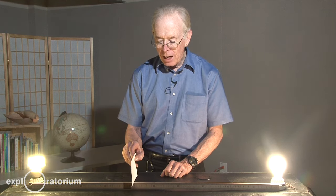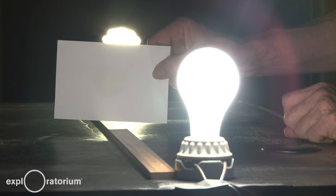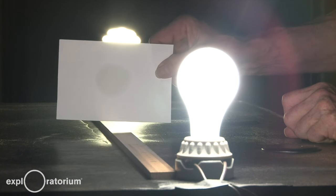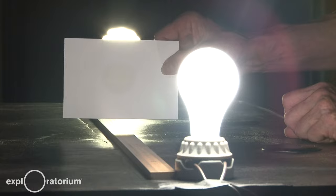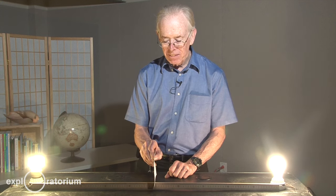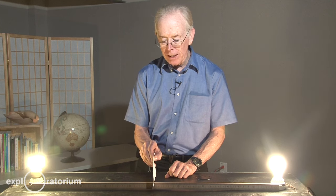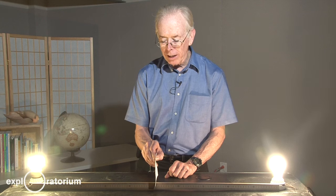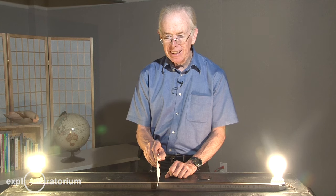Right now I have to be slightly closer to the fluorescent than to the incandescent, which tells me it's not as bright. But as it warms up, it's getting brighter and brighter, and I have to move the card until I find out that it's near 50 centimeters away. So we just used our grease spot photometer to find out that the 18-watt compact fluorescent gives out as much light as the 60-watt incandescent.